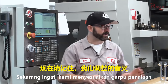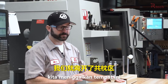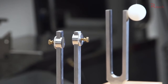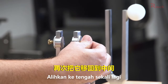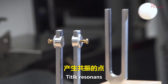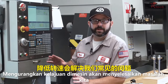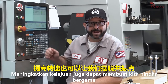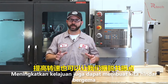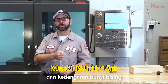But sometimes that's not good enough. When we adjusted our tuning fork down, we got out of the resonance zone — but moving it back to the middle can put us right back in the sweet spot where we create resonance. In the same way on a CNC machine, moving RPM down will often fix our problem, but sometimes — especially with longer tools — moving RPM up can get us out of that area of resonance and stop the chatter. I've lowered my RPM and the chatter goes away for about three seconds, but then we hear it come right back as the tool runs into an inside corner.